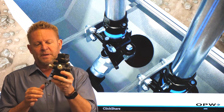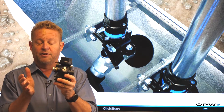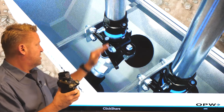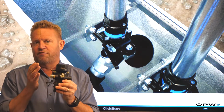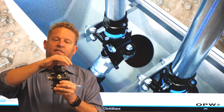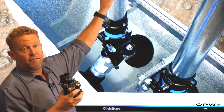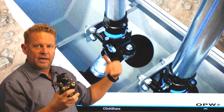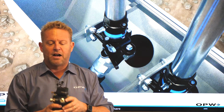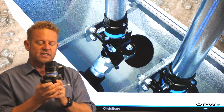Very important piece of safety equipment — every gas station has one. There's a single poppet version, which stops the fuel from this direction. There's also a double poppet valve where there's another poppet inside the top that, when the top shears away, prevents any fuel in the pipe above or in the dispenser from also spilling out, feeding a fire, or ending up in the ground. So a single poppet or a double poppet shear valve — advances in the industry as things have evolved and gotten better.